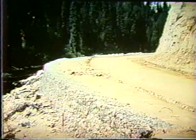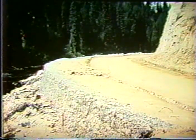Typically for stability, you'll notice that these walls will have these little struts included, and the manufacturers show quite well in their brochures how these walls go together and what distribution of these baskets is to be made for the various heights that one uses. And this is just another application of a low-type gabion wall. So there are literally hundreds of good applications of this product. But I will discuss in the next few slides some potential problem areas.